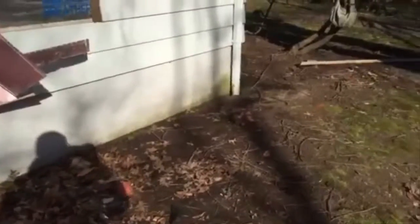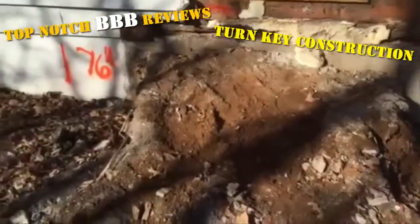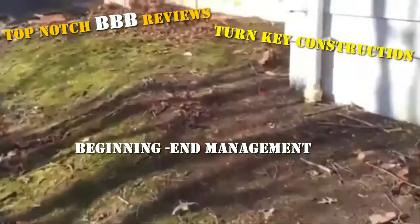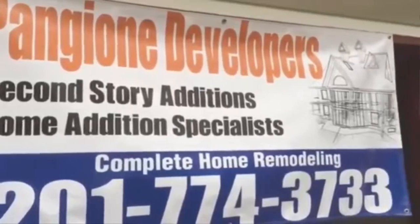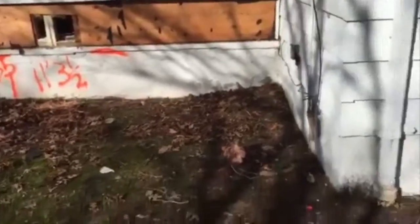We have our machine here and we're going to be starting in that corner. We're going down three feet, coming straight across, doing an extra wide landing with piers, then going across in this direction. We're going to return back to the house and open up this whole area for a footing, and we have to determine our heights off of the existing house.